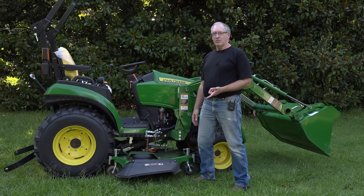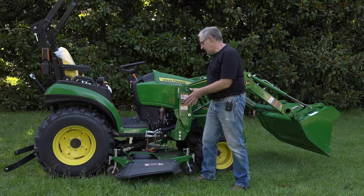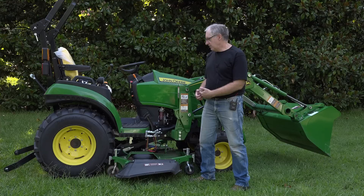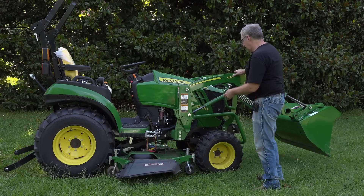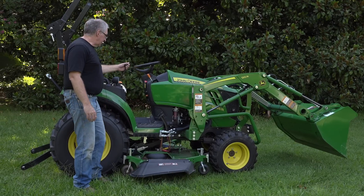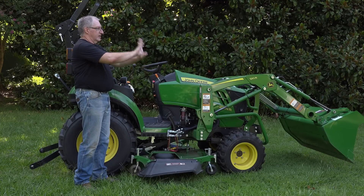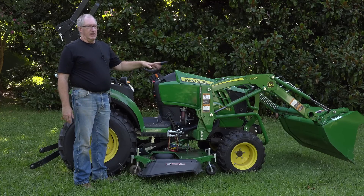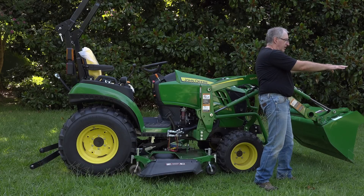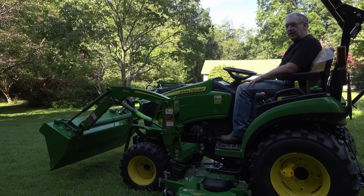Try doing that with a riding mower or a push mower — it's a huge benefit. One of the neat things is that the belly mower can be taken off easily: undo a couple of things and literally drive the tractor backwards off and over it. We keep it on most of the time because most of what we do is mowing. This is the loader here — it's fully hydraulic and I believe it's also a 60-incher, controlled by this joystick. It's fully articulating; I can curl it up, set it up and down, and I can even take the bucket off by releasing these two pins, setting the bucket on the ground, putting the loader down a little bit, and driving away leaving the bucket behind. I'm going to demonstrate how easy it is to take off the bucket.